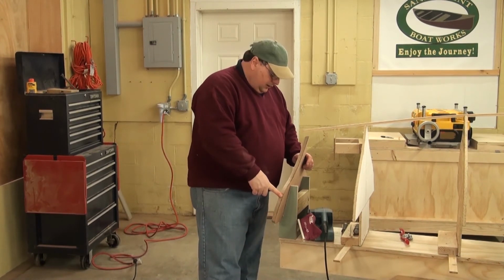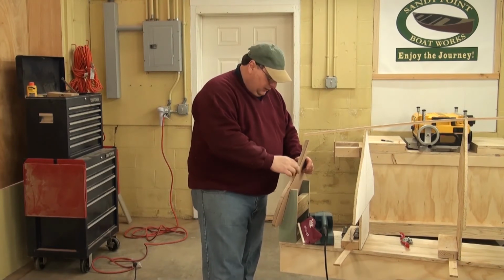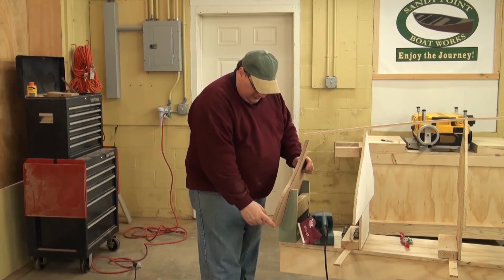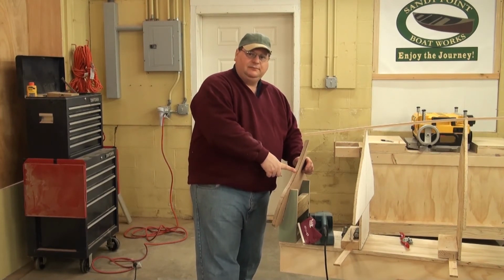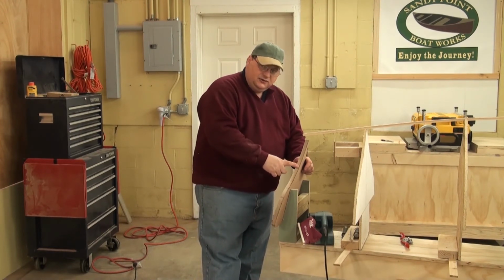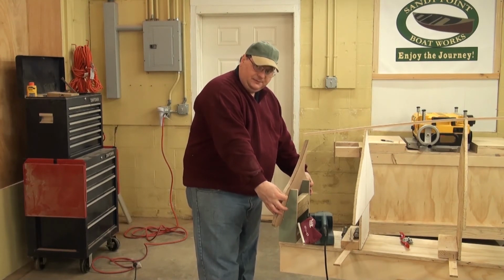And get the rough shape. Now, the key is when you're holding the sander, you don't want to hold it perpendicular to the form, because you'll just rattle that form right off the boat. You want to roll it up and down. What I've done is take a black marker and mark the inside all the way down here. The reason is that you never, ever want to touch that. You don't want to go past that point. That's the magic point where you're beveling this way, and by the time you reach the inside, you're done. You don't want to take anything off that, because the inside is the actual shape of your transom.